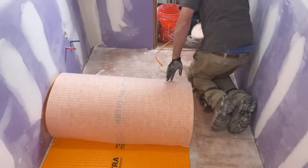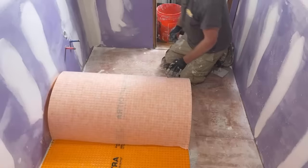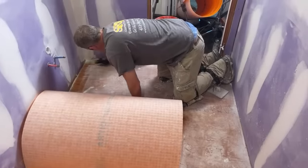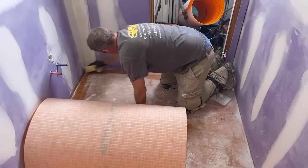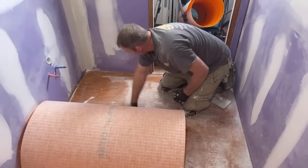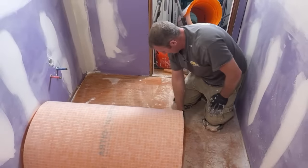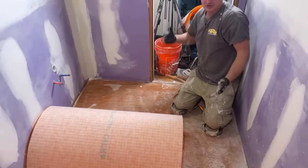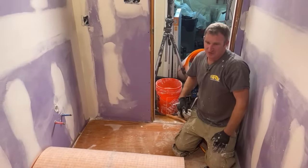Honestly, eBay for all your stuff that you're remodeling, you can probably get a cheap tile saw of reasonable quality rather than renting one. But a lot of times, depending on your tile layout, there's a lot of jobs where I don't even pull out the wet saw, because you just get a good grinder blade and a good sliding cutter. You really don't need a wet saw.